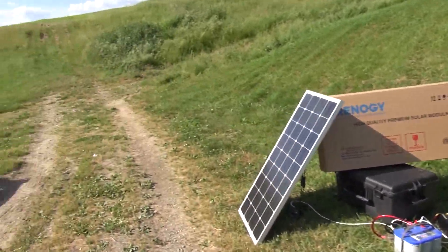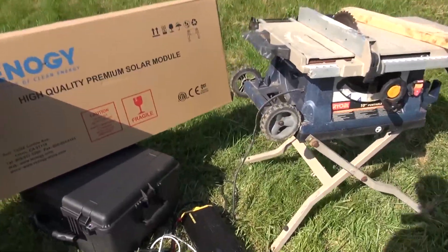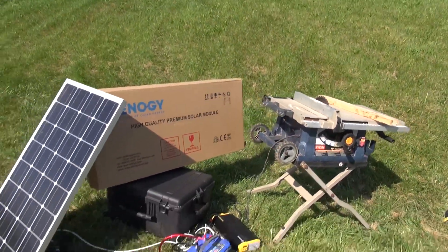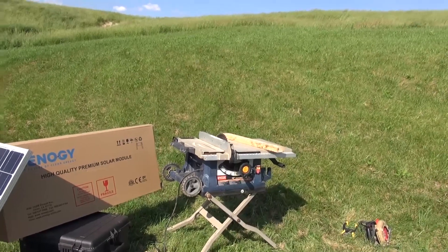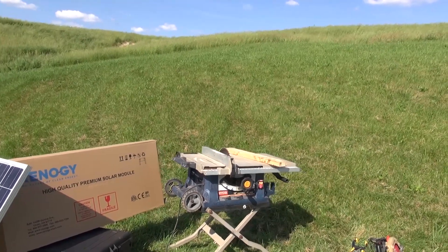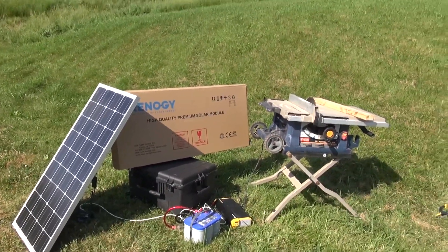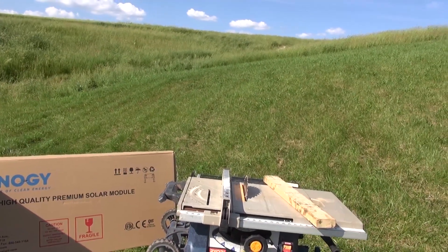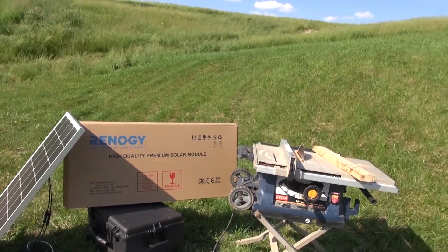Now this is a 100 watt panel — both of these tools will be pulling much more than 100 watts. This is a 2000 watt inverter, so this is not a load that we would be able to do sustained, but in the situations where I would be using these tools it would be intermittent use, and that's what the battery is for. The battery should allow us to do the high load capacity when we need it, and then the solar panel should gradually charge that battery back up. If I'm ever needing them out in the field and have to run them constantly, that's when I would probably lug out the gasoline generator and deal with all the extra noise and hassle that comes with that.